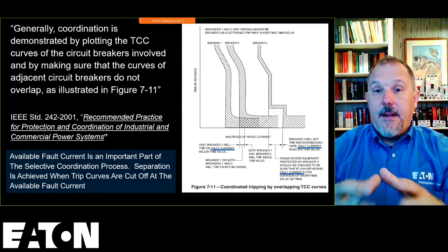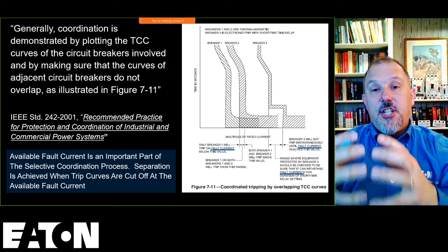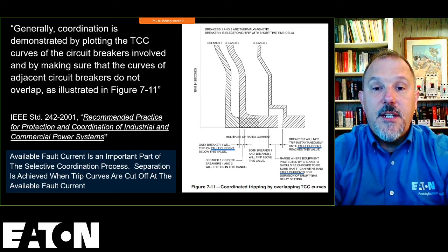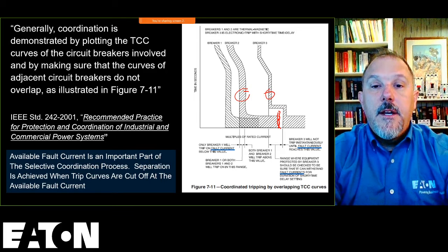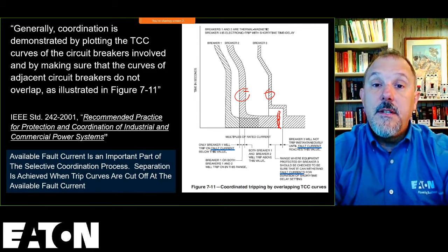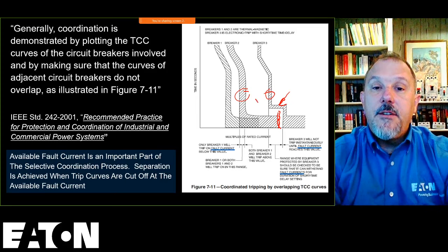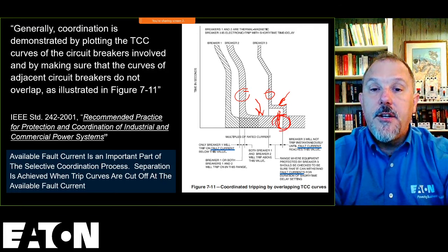And we're going to understand that as we move forward. But the goal here is to generate and give you separation of curves. That's basically what you're seeing. If my fault current is at this point for these two devices, then I have a clear delay in time of the upstream device because of that short time delay. My downstream device will trip instantaneously, but my upstream device will hold its contacts closed, and I have separation of my curves